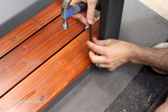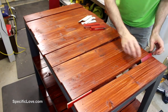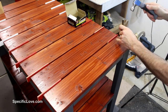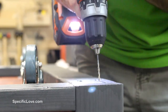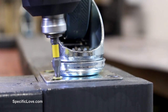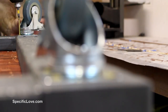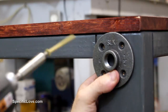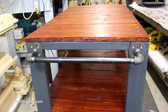To keep from damaging the wood, I used a punch to help flush up the nails with the wood. For the top shelf, I was able to keep my original quarter-inch spacing between the boards. To help this cart stay mobile, I added four lockable casters to the bottom of the frame, making sure to space them away from the pocket screws. I also had to be careful not to over-drill the holes, or this could have easily damaged the shelving.